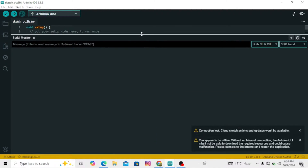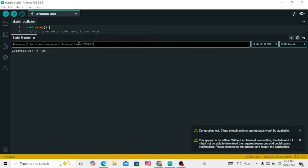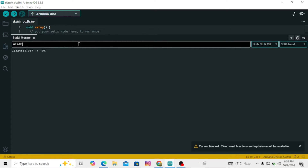After setting up the transmitter's AT commands, we will configure the receiver's AT commands. For this, we first need to connect the LoRa module to the TTL to USB converter, just like we did earlier. Use the same AT commands in the serial monitor. Set the receiver's address using: AT+ADDRESS=2. We only need to change the AT+ADDRESS command — just like we set the transmitter's address to 1, we set the receiver's address to 2. All other AT commands will remain the same as those of the transmitter.